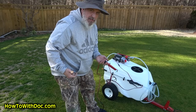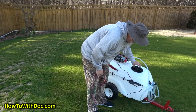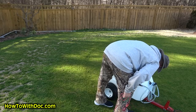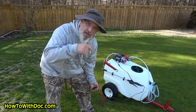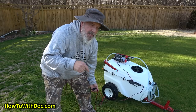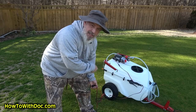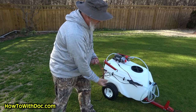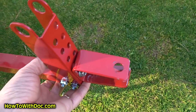The tank unscrews right at the top — it's nice and wide. It has a filter screen on the suction tube inside, plus a constant pressure-relief spray that shoots back into the tank. So as you're jostling along, there's another stream inside keeping the tank mix agitated. It's actually a pretty good system. I did a modification on this I'll show you in a second.